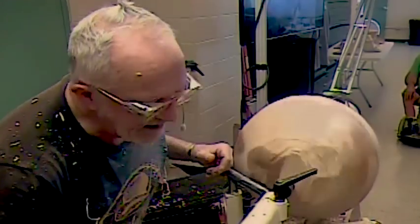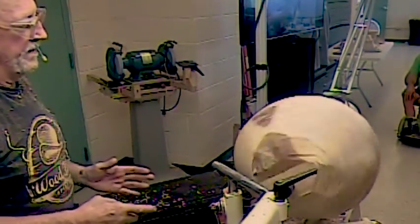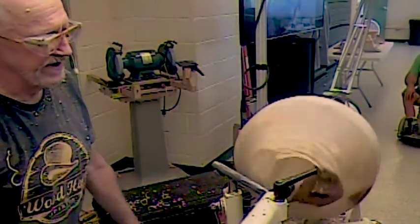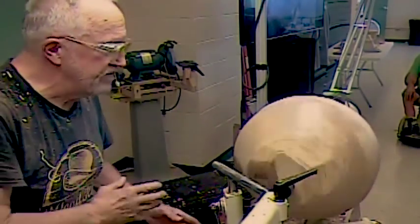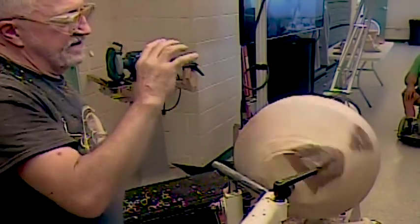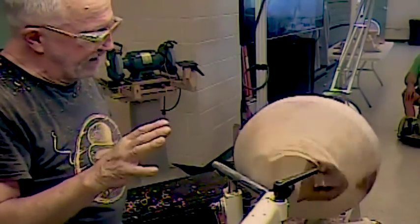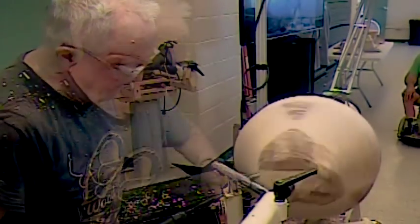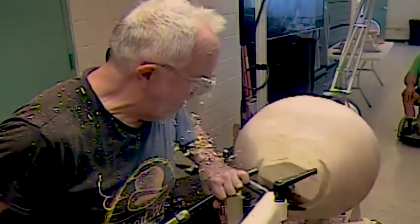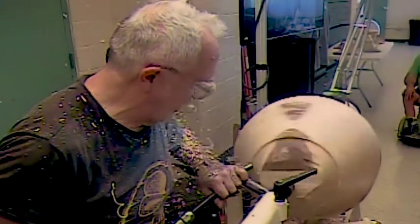I was convinced that I had to apply a faceplate and leave it there until I'm ready to do the top. You can make it run true enough. Because when I'm reversing a hat, it has to run absolutely true. Because I'm going this thick, I can't have it moving even a 64th or 128. Nothing. Zero. It has to be perfect. You can do that with a chuck mounted here. But I apply the chuck now while it's still... Everything I've made so far, I want to be true to.